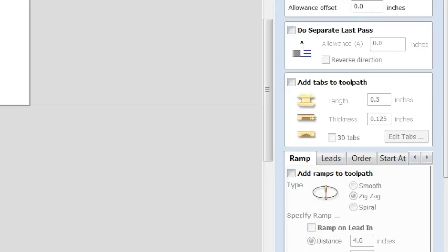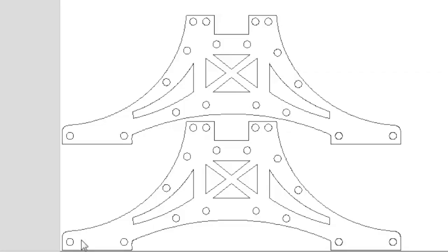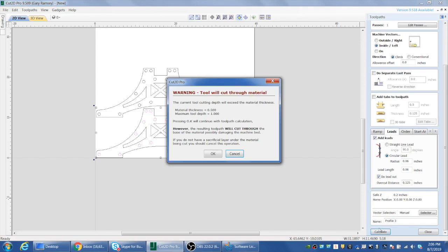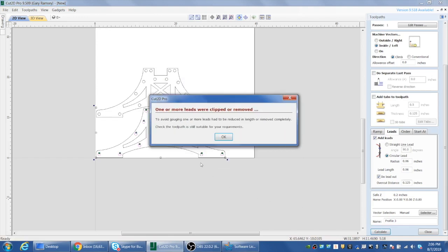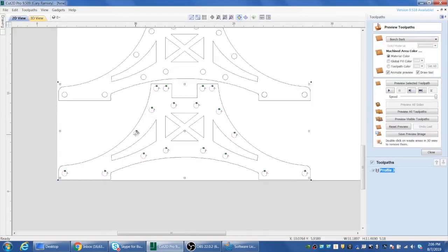Then I'm going to go down here to inside offset - we're going to offset the hole and put a really small lead-in and lead-out because we don't want it leading too far when we recut the holes. I'll hold shift down and select those. You can do this in SheetCam as well, a little bit different, but I've done this exact same thing in SheetCam before. Now the only thing it's going to create a CAM toolpath for is those first set of holes. I'll hit calculate and it's going to give us an error message that we'll ignore.